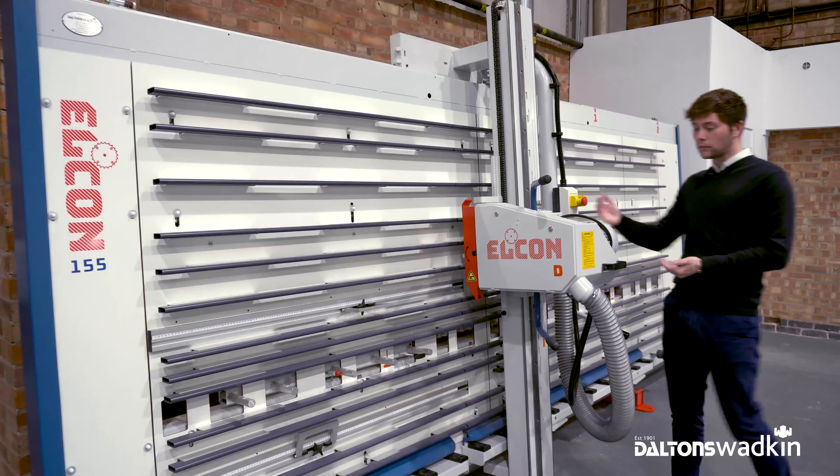We've got two independent measuring stops on the Elkon D, both manually set and adjusted. For example, we've got them both set at 500mm now, so when cutting vertically you'd be achieving a 500mm workpiece. If you wanted to add on a metre, you would unlock the beam and take it to the metre mark and lock in place. And if you wanted to cut 2.5 metres, you would unlock and take it down to the two metre mark. These can be flipped away when not being used, and they're easily adjusted — going all the way up to 1,300.